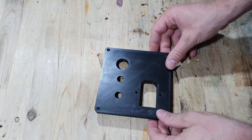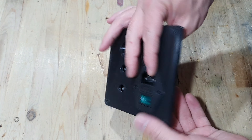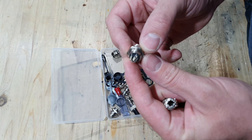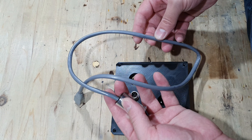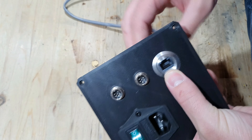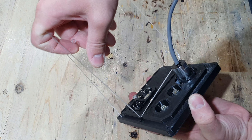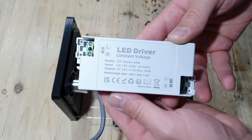I have to cut some more thread inserts. I 3D printed this backplate which holds the sockets for the cables connecting the controller with the gauge and for the power cable. In my last design I used an external power supply but it was annoying, so this time I integrated the power supply into the controller. For two of the three available inputs I'm using six-pin aviation connectors, but for the Inficon PSG500 I'm using an RJ45 connector since that's the one the gauge uses. The 3D printed backplate has slots where the acrylic boards fit, creating a two-layer design with the power supply and step-down converter for the Arduino at the bottom, and all other electronics — voltage divider, ADC, Arduino, and multiplexer — on the top layer. This way I can just slide the whole assembly in and out of the housing.